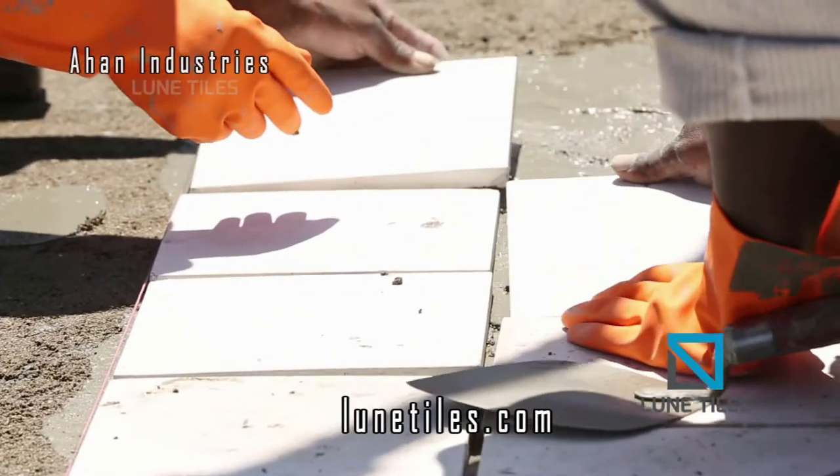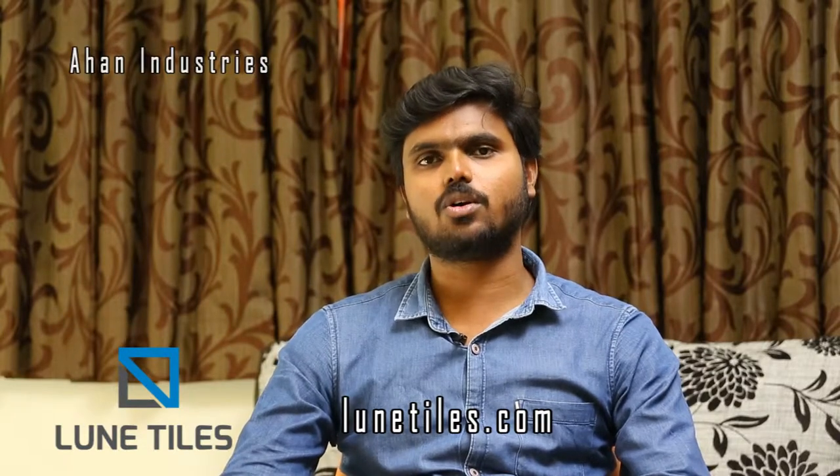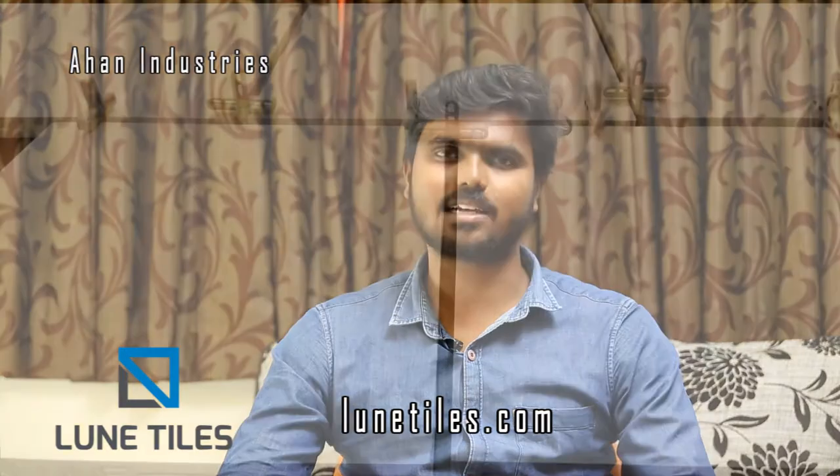So why do we need an 8mm gap? What is the point in that? While laying the tiles, the 8mm gap ensures the pointing material is filled completely in between. If you are not giving the 8mm or reduce the 8mm, the pointing material will not fill completely inside, allowing a vacuum to be created. At any cost, that vacuum can develop a crack in the tile.